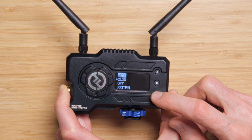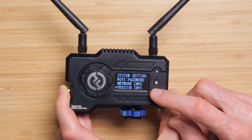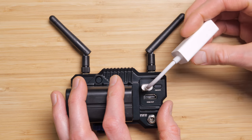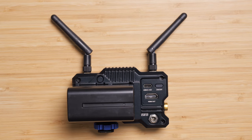I really like the simple menus on both the transmitter and receiver — you barely have to get into them under very few circumstances, and they're super simple. There's not a lot of learning or special button combinations required, which I appreciate because there's so many different pieces of gear on set. One kind of unique feature is it has the ability to create an RTSP stream. Typically you'd use that to transmit from the receiver to some other remote viewing monitor over an Ethernet network using a USB-to-Ethernet dongle on the receiver.